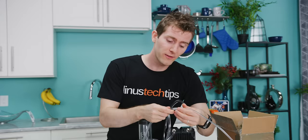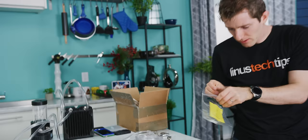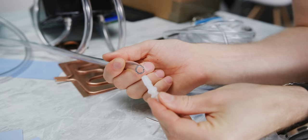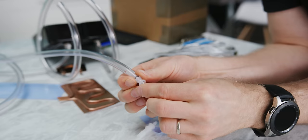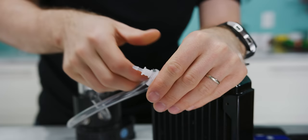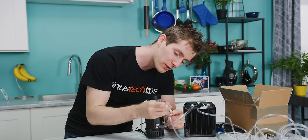One way of adapting larger tubing to smaller tubing is to just place the smaller tubing inside and use some kind of sealant. But we're gonna go slightly less janky than that today and use these handy little couplers I found on McMaster-Carr. These little puppies are gonna restrict our flow a little bit because of the shape of the flange and how they're a bit undersized, but they'll allow us to take our quarter-inch tubing and go all the way down to this tiny one. One pro tip: if one zip tie is good, two must be better.